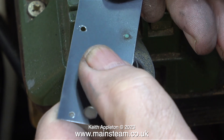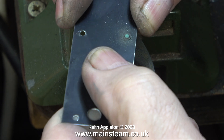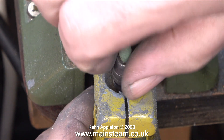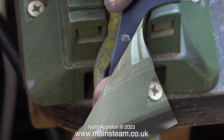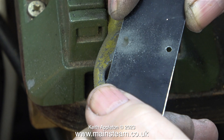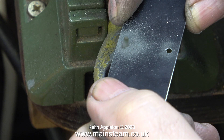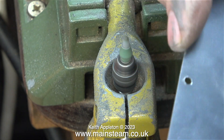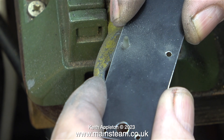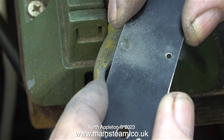For these holes, which are much smaller, I need something a little bit more pointy. This grinder is only the right size right at the tip, so I'm changing the tool for a different shape grinder. As I mentioned earlier, these small grinders really are very cheap and cheerful. Here are some quick tips: do not use a twist drill, do not use those type of burrs that are really aggressive, and do not use a milling cutter under any circumstances.